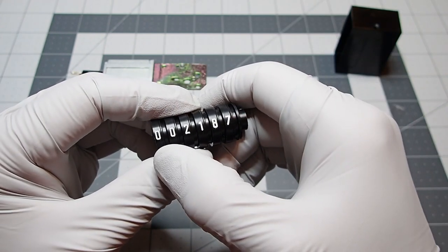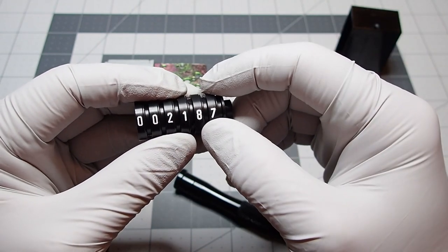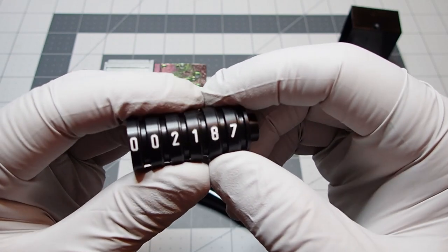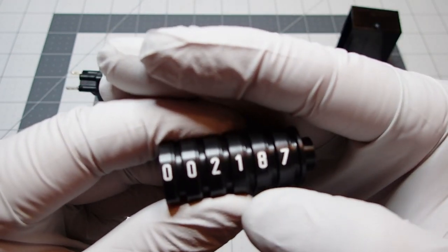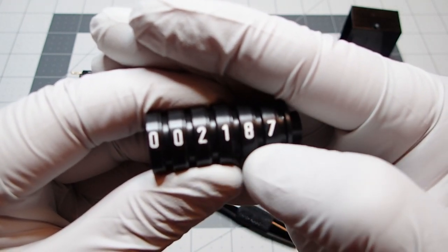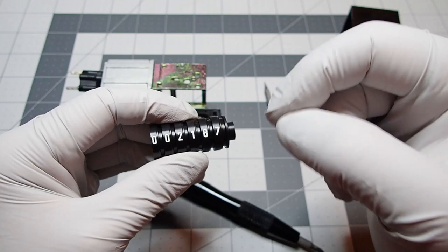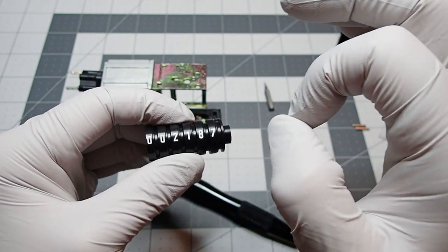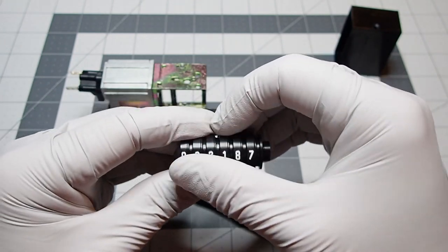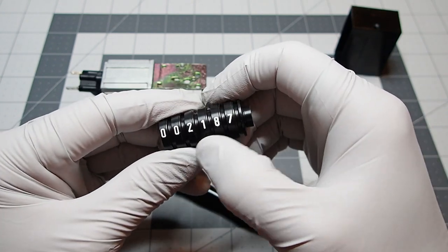And then afterwards, I basically use the crayon method. So take a white crayon, rub it around, and then I would keep working at it to fill those holes. And then at the very last step, I did notice that there were some divots and it just didn't look very smooth. So I ended up taking a hairdryer and ran over it. It melted the crayon just enough to smooth out everything, and there you go. Then I cleaned it up with a very slightly damp paper towel, and then you're able to clean up everything.